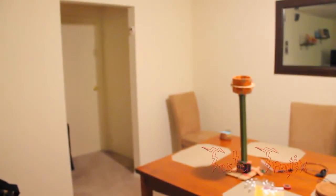Some really neat plasma. It does get warm, it definitely does get warm. However, in the previous video when I powered the incandescent bulb via the ground wire, the bulb itself does not get hot. If you actually plug that nightlight bulb into an outlet it would get warm because it's producing that wattage - it's probably like a small 20 watt incandescent bulb - and that wattage is dissipating as heat. When it was lit in my hand it wasn't generating any heat. So that's another thing to take into consideration. It's just this high-frequency RF basically blasting out electricity.